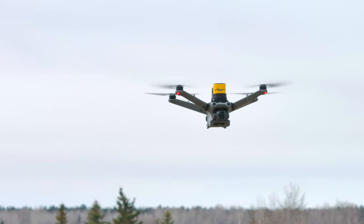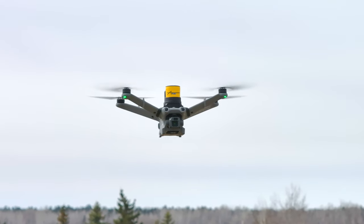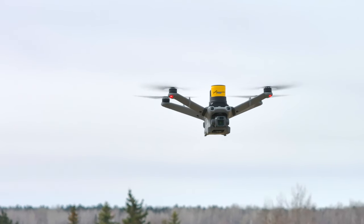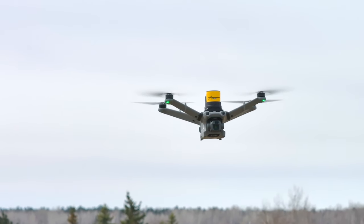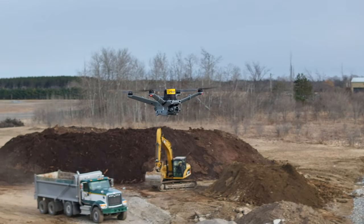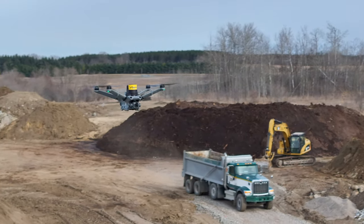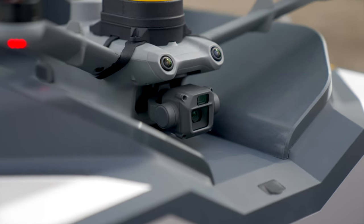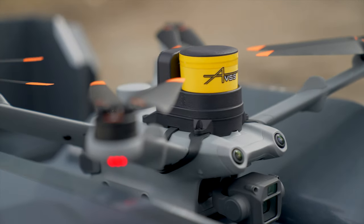shots here. Now, the reason that this is important is because this drone was built to fly autonomously with very little human interaction, which of course begins to butt heads with the regulatory limitations. Rules like maintaining visual line of sight and no flight over people would really hinder the use of a fully autonomous system like the Dock 2, but with the use of a parachute, it gives you the ability to submit waivers for these special operations. This is why parachutes on drones are great.